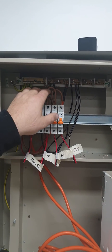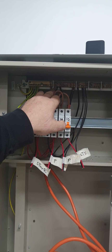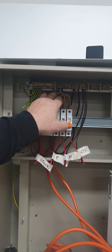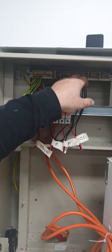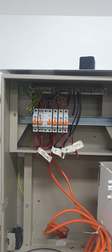The MEN link is a solid bar. The only thing I'd probably recommend is making sure that you've got an insulated main MEN link, just so that when you pull it out it's more identifiable. These bars are more suited for when you have the neutrals joined together and keep them all in one piece. But outside that, all a good job.